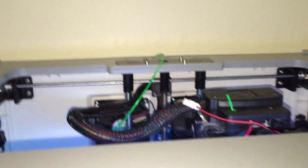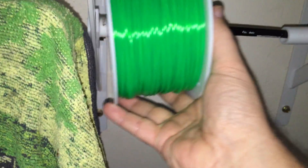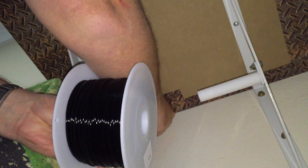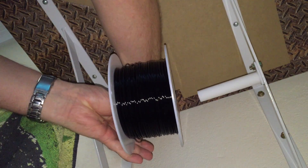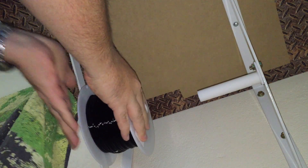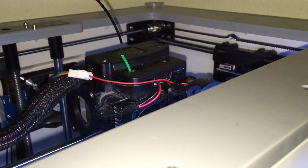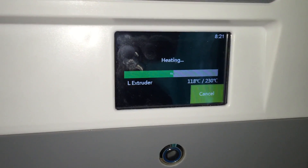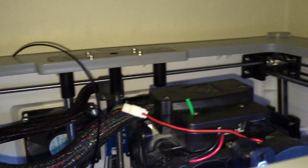I'll snip the last bit of filament we used — I don't worry about unloading it. Here's my filament holder; the pen is just a backup. I'm going to do the button in black. Just poke the new filament up through there — no problem. Lift the black up and when that's ready we'll poke it through. From the home screen: tools, filament load, left — and we'll wait for it to warm up.